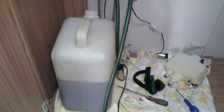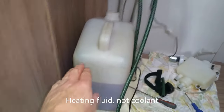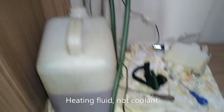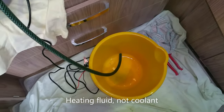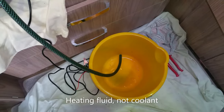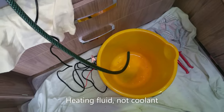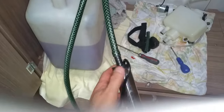So now I'm all set up, ready to start the injection of the coolant. I've got my 15 litres of new coolant here and a bucket so I can view the stuff coming out. I'll be looking for the new coolant's colour to appear at that bucket, and when it does I'll turn it off. I've connected my new pump to the end of the hose going into the drum of new chemical.